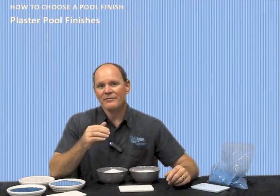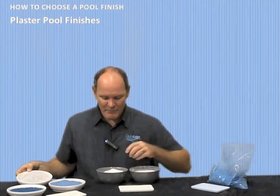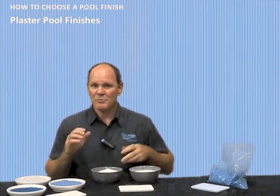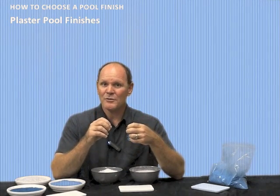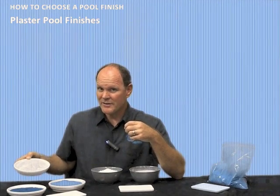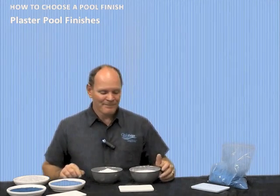Again, by definition, for my definition at least, a quartz pool is nothing but 100% quartz aggregate mixed with white cement. Anything less is not a quartz pool. It's plaster with quartz thrown in it. So if someone tells you they're giving you a quartz pool, make sure you get them to commit to or admit that they're giving you 100% quartz. Not 20%, not 60%. It's got to be 100. So just please don't be fooled by that.